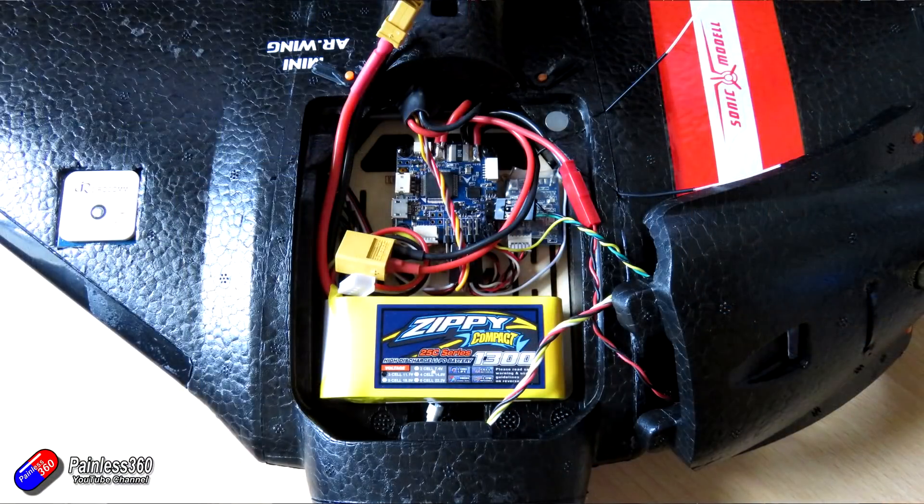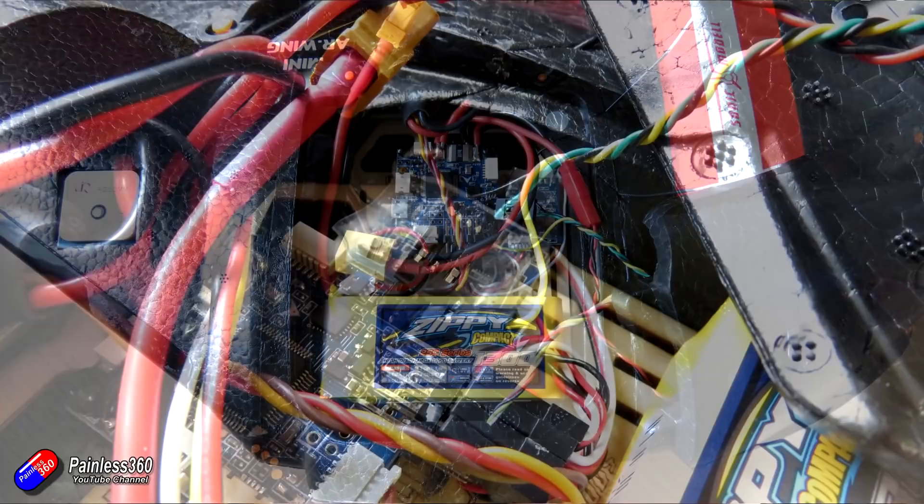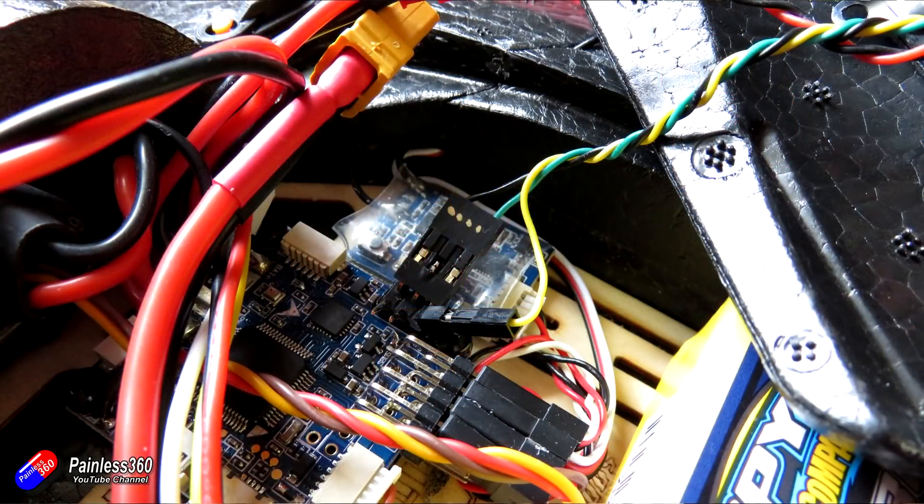Once that's done, the next job is to make sure I haven't made any mistakes - do a visual inspection of the wiring, make sure nothing is going to make the magic smoke come out. Put a multimeter over the pins on the power input to make sure it's not a dead short. Do one big final inspection: make sure the ground wires go to ground, signals go to the right places, and that the ESC and servos are all plugged into the right outputs as configured in the last video.